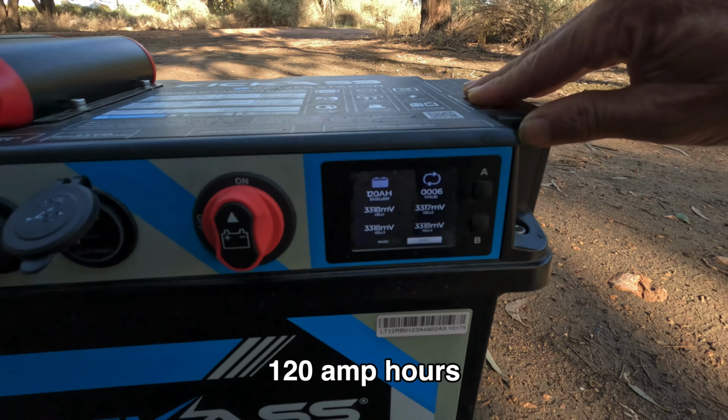Now I have to connect the positive and the negative to an Anderson plug, so I can plug it in to where it goes in the battery box. There, you can see it down there. So once this is dried, I'll tighten these cable glands, which will seal these up there, waterproof. And I'll hook up the other MC4 connectors, and the solar should be going.